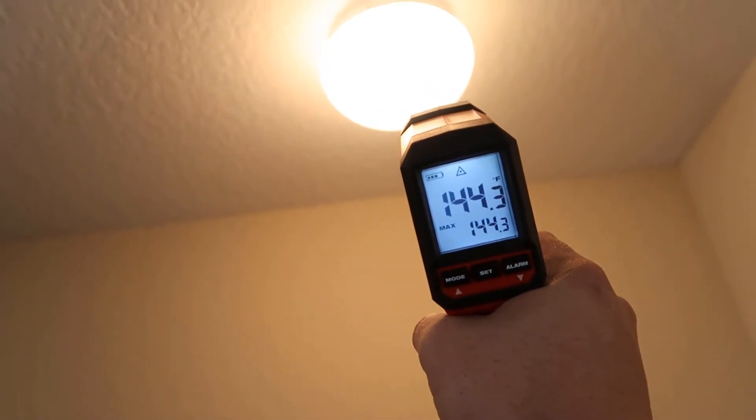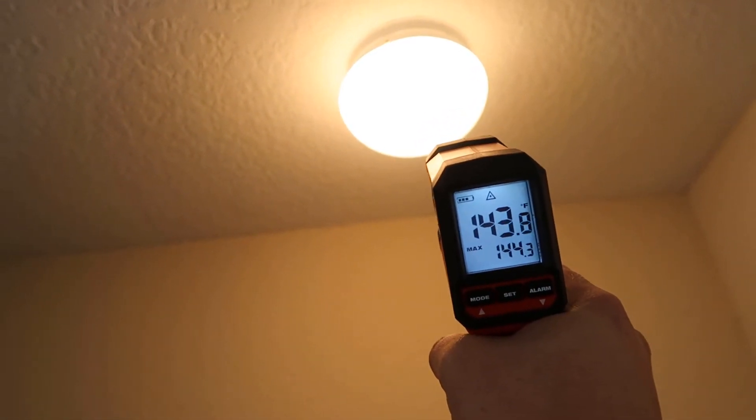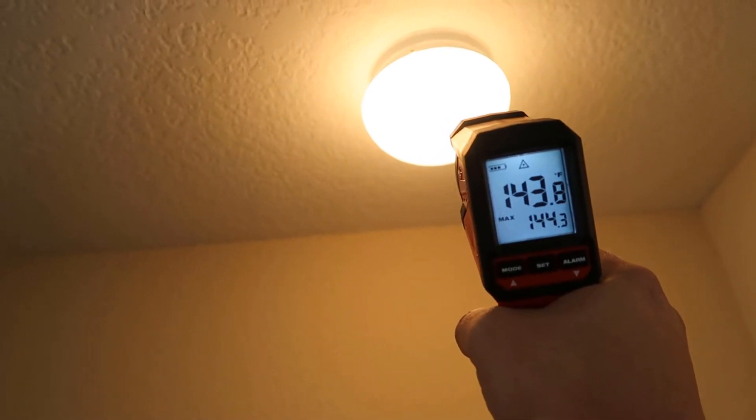To try to demonstrate that, I'm going to shoot the temperature of this light behind me. I put a bead probe on it beforehand - it's about 142 degrees, generally around 142 depending on where on the cover you put it. So we'll get right up on this first. We're maybe a foot away, so you're talking about a one inch sample size. It's reading pretty close. Any inconsistency is going to be that the light has a little bit of reflectiveness to it, which will play with it a little bit.